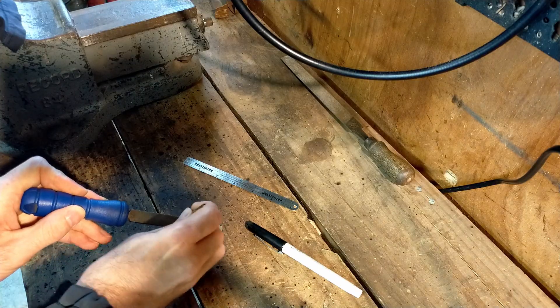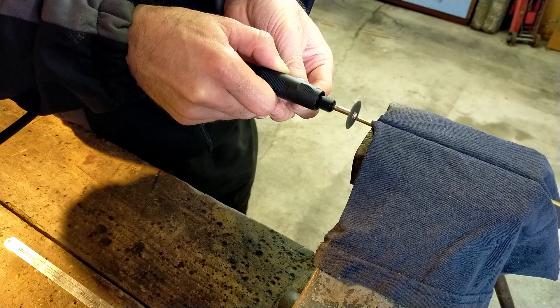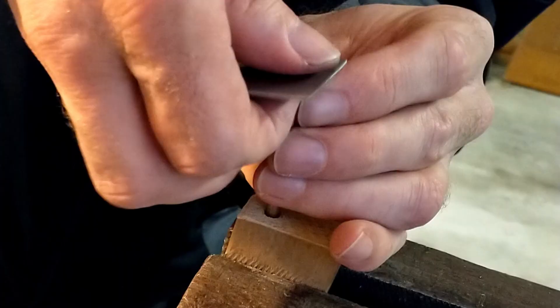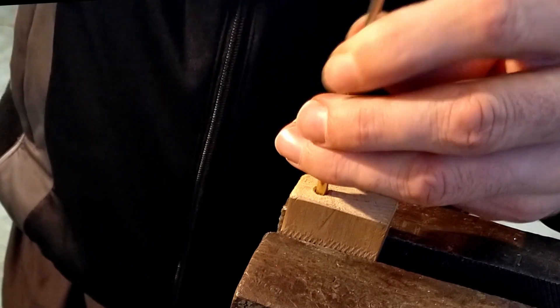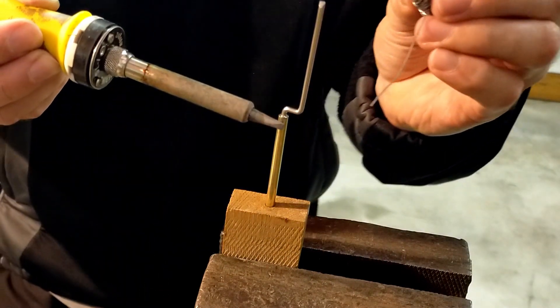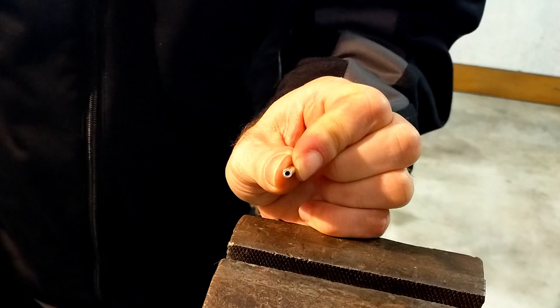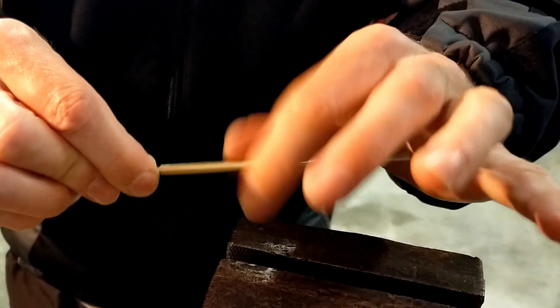Now that I have this cut I file off the burrs. I do the same for the rudder tube. Next I create some bushings — they have an inner diameter of two millimeters and an outer diameter of three millimeters — meaning they will fit inside the prop and rudder tubes and support a two millimeter stainless steel shaft. I insert the bushing into the prop tube, then use a three millimeter drive shaft to push it down about one millimeter to create an area to hold some solder. I settled on using a piece of two mil push rod with an angle bent into it; this prevented the two mil shaft from falling too far down into the bushing, making it much easier to remove. I did the same for the other end of the prop tube and the rudder tube — they both spin freely on a two mil shaft.